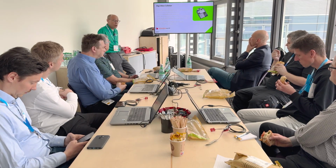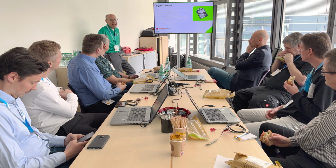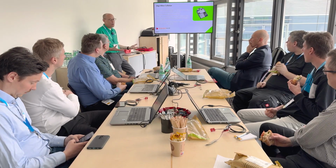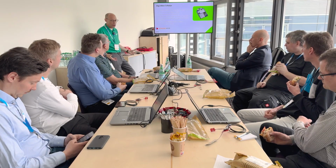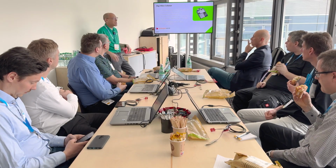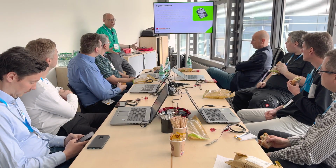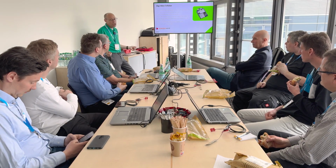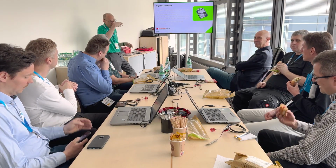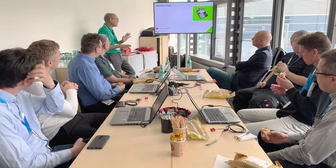The XBee Cellular we're using today supports LTE-M or Cat-M and NB-IoT. It can be put into either mode. Both are low bandwidth cellular LTE protocols. They work a little differently. Today we're going to be using LTE-M. We also make modules that support Cat1, which has more bandwidth, and Cat4, which has even more. LTE-M behaves basically the same as the other two, which is why it's nice to use. NB-IoT is a little different structure, so we can talk about that a little if people have questions.